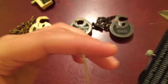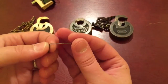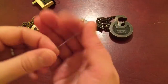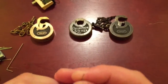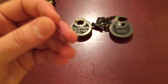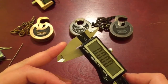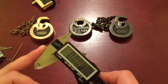It has to be 90 degrees — if it's round it'll cause headaches, so make the inside angle 90 degrees and the face flat and 90 degrees. That's tool number two. Tool number three is a simple piece of wire — I got mine from a flower store, you can probably get it for free there, or use wire ties with the plastic stripped off. Bend it to give yourself a handle with a 90-degree turn. File down any flaring on the sides. Mine is 19 thousandths. Sometimes 25 will work, sometimes 15 or 10 — it depends on the lever thickness in your lock.